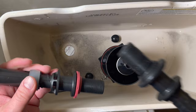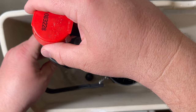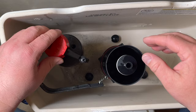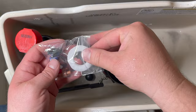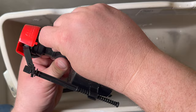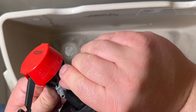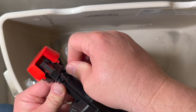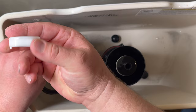Here's the new hose. I'm going to put this in place — this has a nice seal, this is actually an improvement from the original manufacturer. I'm just going to push up on this a little and slide it down in place like that. Pretty simple. I do need to put on the hose attachment over here. You see these little grabbers right here — this goes up on top and it's just going to grab right into those little grooves. It locks in place, just enough to keep it in place. Now I'm going to get back down underneath and put the lock ring on.